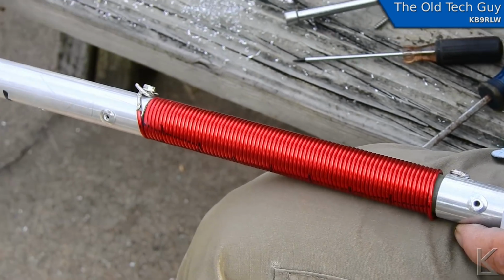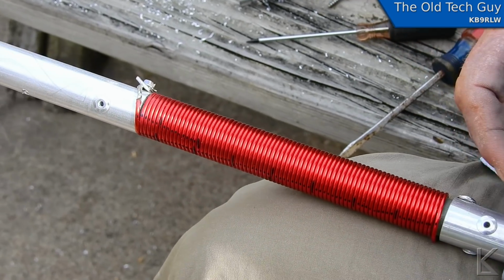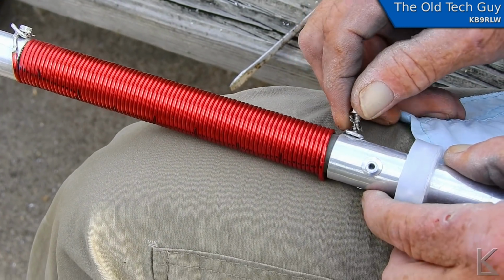All the rest of the traps, though, we had to take them apart, add 2 more screws offset, and add the star washers and make sure that the screws were nice and tight just to make good, solid electrical connections. Every single one of them needed work.